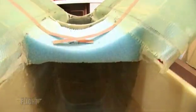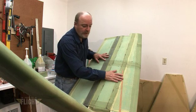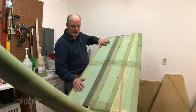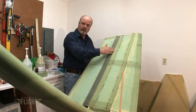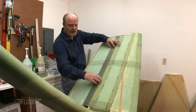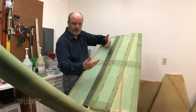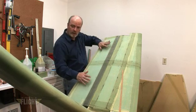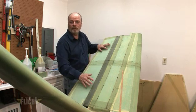As you can see, the entire V-tail is constructed on the airplane. I've installed my antenna underneath the fiberglass for my radios. The next step is to take this entire section and remove it — I'll cut along this line on the top and bottom side, dig out the foam underneath, build up some fiberglass layers for reinforcement and strength, add the three hinges, and that will give me a movable surface. This will be my elevator and my rudder — thus the term ruddervators.